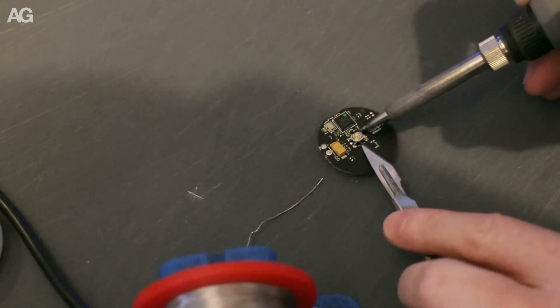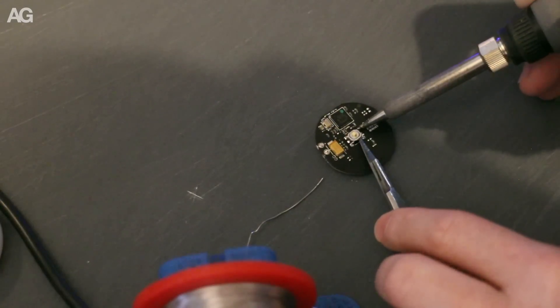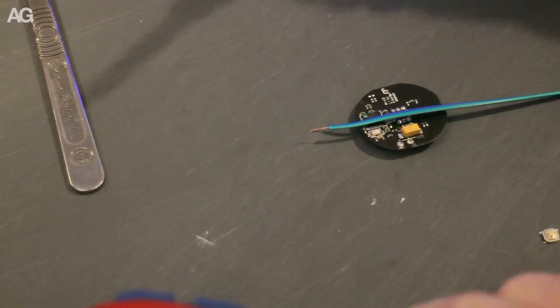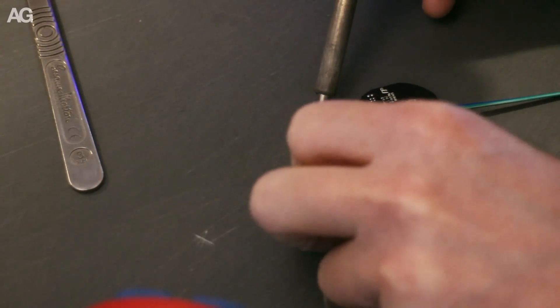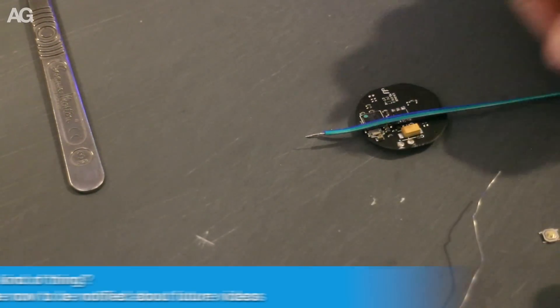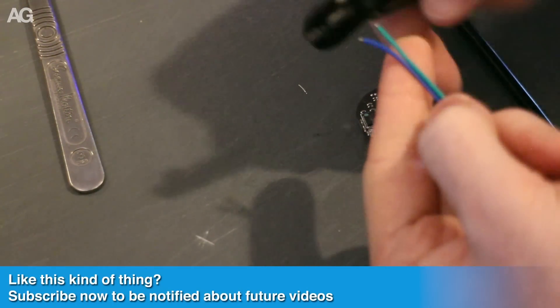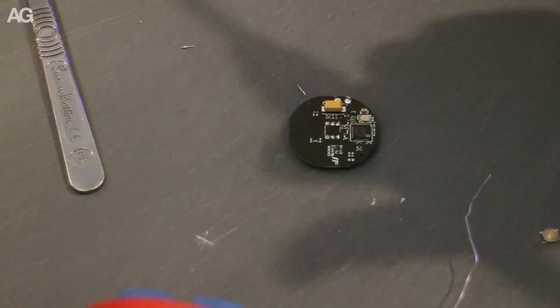The wiring of these is fairly straightforward, so I knew I should be able to attach onto it without too much difficulty. With the switch off, I was able to solder on a couple of wires onto the two main pads which would activate the switch. These wires can then connect into the light switch just as normal, and basically joining the contacts would trigger the button press.